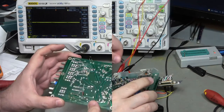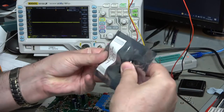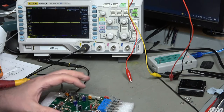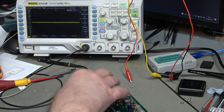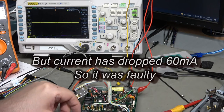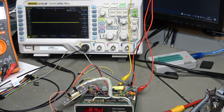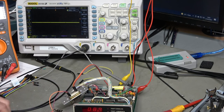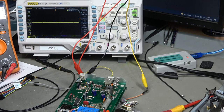Turn everything off and start taking it apart again. That's supposed to have a 741 in it apparently - here is the new 741. One nice new 741 op-amp. Reassembled - but still got readings all over the shop, still got minus 2.97V. Let me also just double-check this pot here because it's crappy.